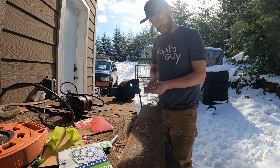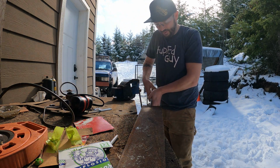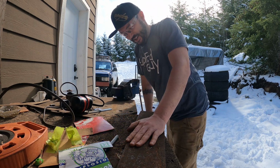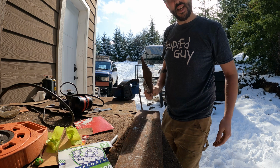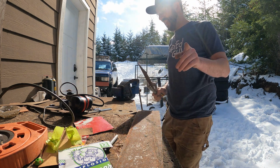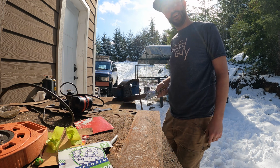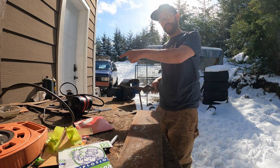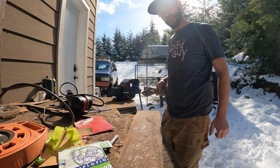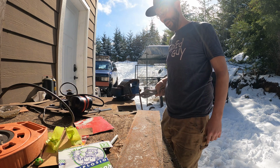Here's some actual tip for fabbing today. You'll see me do this a lot. My good buddy John taught me this one. You don't actually have to cut all the way through when you're cutting flat bar. You cut 2/3 of the way through, and then you snap it off. Makes your disc last longer. And we all know how much of a cheapskate I am, so anything I can do to make my cutties last a little longer. We're on cutty number 4 so far on this bumper, so we'll have to add that onto the price tag when we do all the math here.